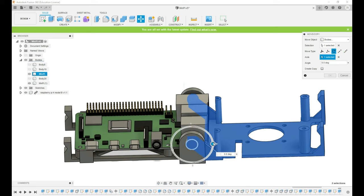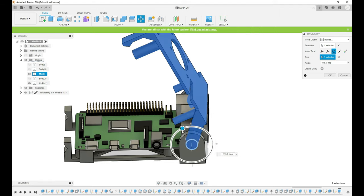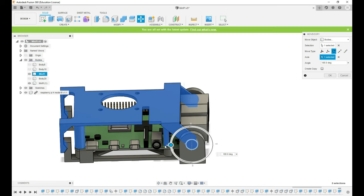Other things we have to keep an eye on — in my case design these posts are designed to snap onto the top of the Pi and make sure it's held permanently in place. We need to make sure there's enough room for those to move around the components on the board and not hit anything or damage anything. I also modeled the case so that you could have a fan mounted to it if you wanted, and the GPIO and basically everything's accessible, so it just acts as a protective cage. We'll send this version to the printer and see how we make out.